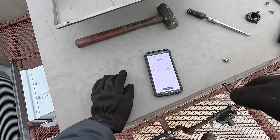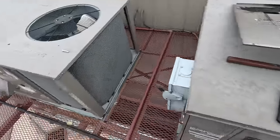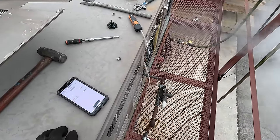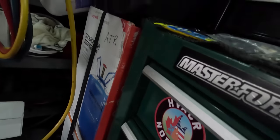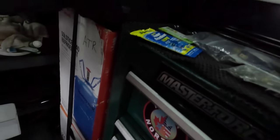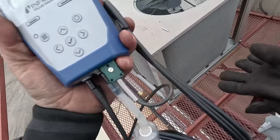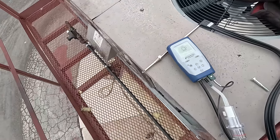So we're at 12 inches right now, shooting for nine and a half. This one's been running steady, no problem. That blower's got some problems. Lucky me — I have a Testo and an Inficon combustion analyzer. We're going to check that over and see whether or not she's running dirty, sampling the outside air. I'm going to check this other one and see how it's burning once it's calibrated.